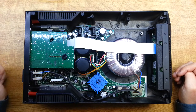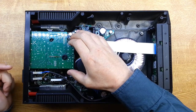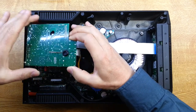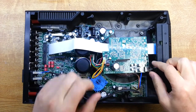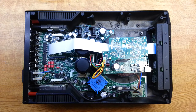First thing I see is the solder joints there are a bit less than ideal, but anyway. We just need to remove the headphone nut from the back, and then there's a connector on the board that allows us to lift this off and turn it over. This is just the headphone amplifier — there's a little power supply here, and then it's just an op-amp driving out to the headphone.